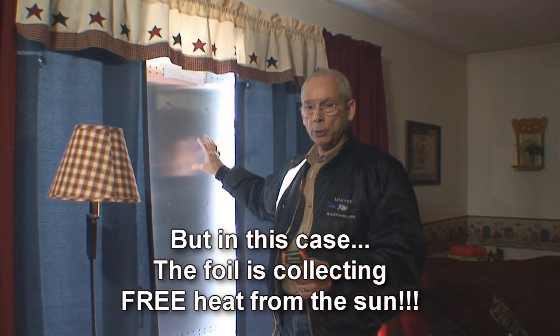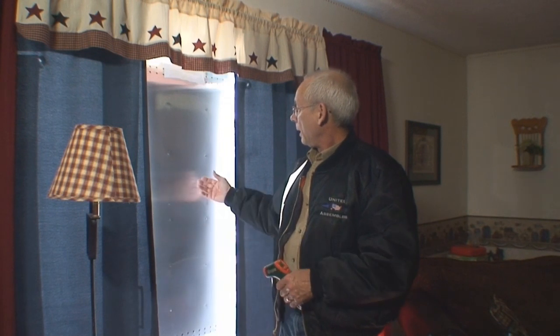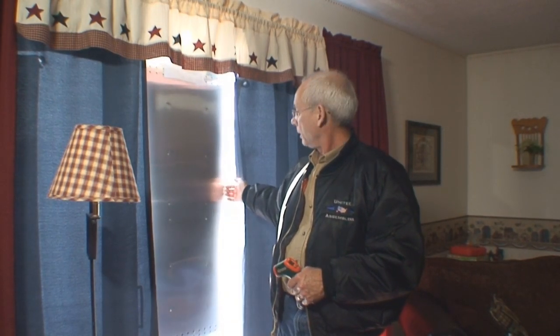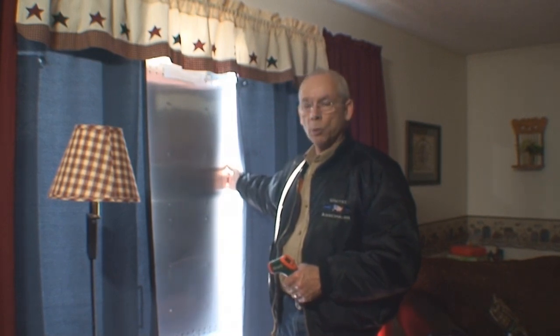What the film is is a black foil that's used in theater and a lot of television studios — a black foil used to control the lighting coming off of studio lighting. It's fireproof. The whole unit is made out of materials that are not flammable. The framing is just framing you would use for a regular screen window. It's sandwiched together with the film on the inside, and then the external clear part is just a clear plastic film that you put over your windows and use a hair dryer to shrink down to make it nice and tight.